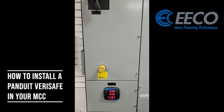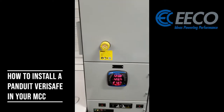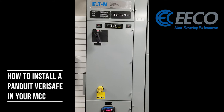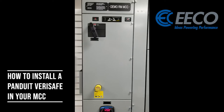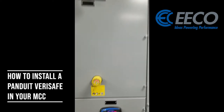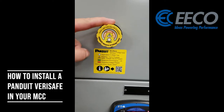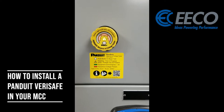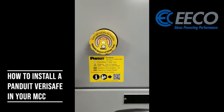This is our Eaton MCC. As you can see, I've got power on — it's 240 volts. There's the Panduit VeriSafe, and I have it installed on the main disconnect of our MCC. There's a breaker inside that MCC that provides power to the whole unit, and then a disconnect locally on the wall that shuts off power to the unit. You'll notice there are red lights on it, as well as a sticker telling you what the lights mean — red means hazardous voltage present. If I hit this button to test, you'll see it's flashing, and once the test is complete, we still have red lights, which means there's hazardous voltage present.